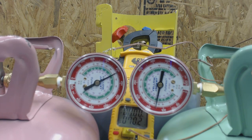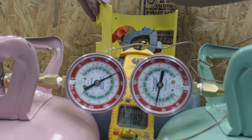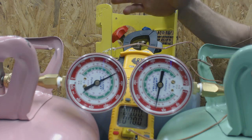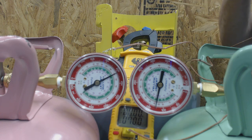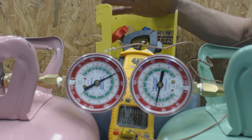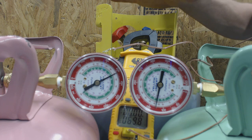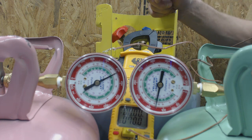This video is about how to tell what refrigerant is in a bottle — specifically a recovery bottle. A recovery bottle is gray and yellow. If you have a unit located outside, like a package unit, and the unit hasn't been running for an hour or so, you can tell what refrigerant is in it even if the rating plate is worn off. You can also check the compressor rating plate.